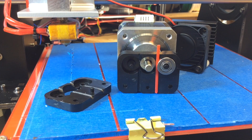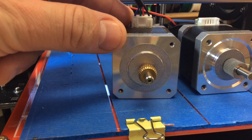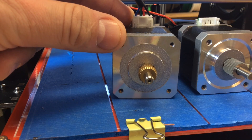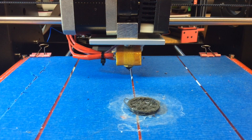When I tore the extruder apart again it was clear it needs some kind of pressure on the filament — this design just doesn't work. I decided to try changing the gear and then the motor, thinking maybe the motor was the problem. I tested the original motor and then tried a new motor with a new gear, but it was jumping back and forth. Even after rewiring it to work with the new motor and gear, I got the same results. That wasn't the problem.